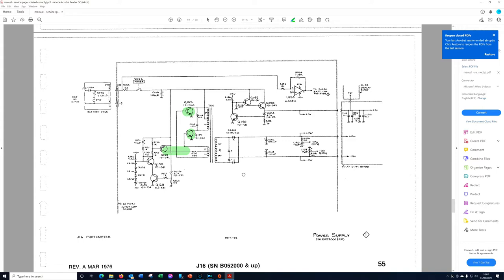The multivibrator is a possibility, but perhaps not the first place to look. Where I would look is in this half of the circuit. What could be drawing a lot of current here? There are four tantalum capacitors here which warrant a good look - maybe just straight replacement without even bothering to test them, since we'd probably want to recap anyway. They don't need to be tantalum; they could be electrolytics. Also this 741 op-amp - if that's faulty and drawing too much current, it would discharge these capacitors too fast and the multivibrator circuit would compensate by turning on the transistors for longer.